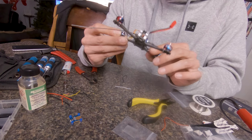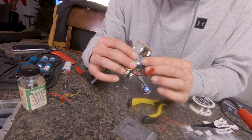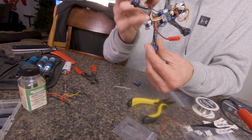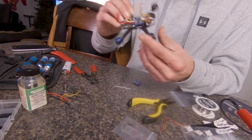The receiver is soldered up, the battery is soldered up, the motor wires are soldered, and the camera is plugged in - that's really all there is to it. The rest of the stack just connects via pins between the two boards. I still need to figure out where to mount the antenna - maybe under the arm or somewhere over here. I'm going to go ahead and finish conformal coating all this stuff, then jump over to the computer for Betaflight setup and a motor test. Let's time-lapse through the conformal coating and VTX installation.